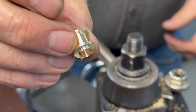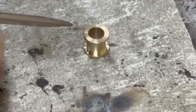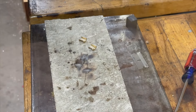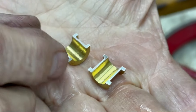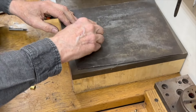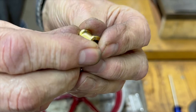There it is. Now we'll just take the torch to it and take it apart — I'm going to melt this apart and we'll have our split bearing. You can't even see the seams in it, but they're there. Now as you can see, there's a little bit of solder on here. I'm just going to take them to the sandpaper and clean that off. I'm not going to get real aggressive because when you fit these, let them be a little tight and then finish them later. I'm leaving just a tiny bit of solder on them and those will fit together perfectly.